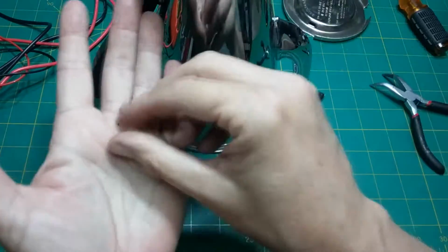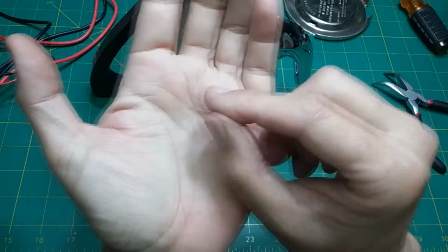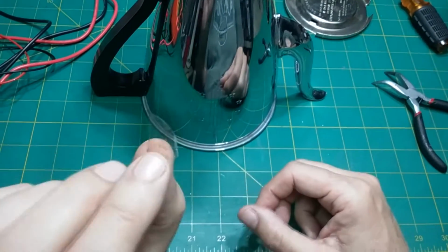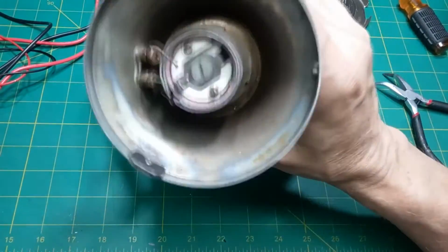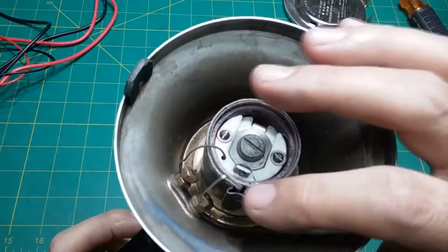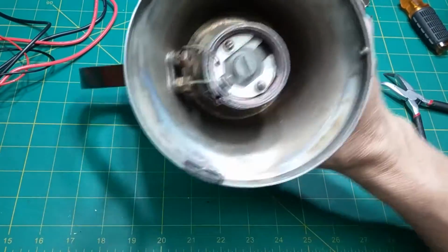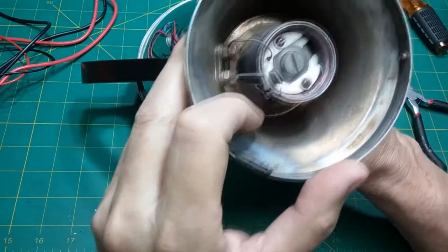Well, so where's this fuse? Oh look, piece of mica. See that? That's mica. It's hard to see, right? And mica deteriorates. Gets what's called silver mica disease. That's what's in here. This is a layer of mica, all the way around as insulator, and they use it to insulate coils and such. And this has a clip that's holding it on.